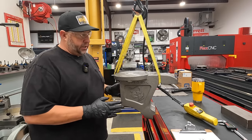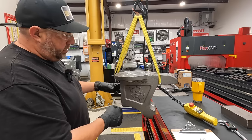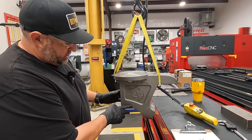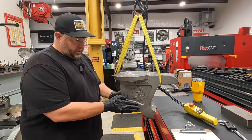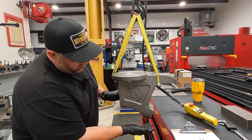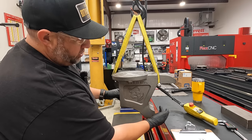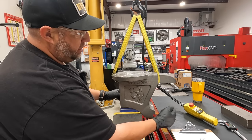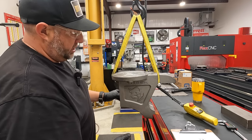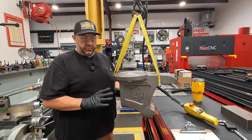All right, so my plan of attack for beginning the machining of the main body is we're gonna be clamping it in a mill vise, just like you see right here, over there on the KBC mill. And since there's enough area right here, we should be able to clamp this in the mill vise, let this hang over towards the mill table. And what we'll do is we'll set up a machinist jack over here on this side and a toe clamp to support this.